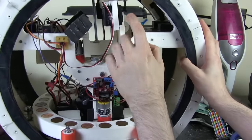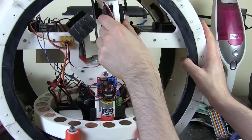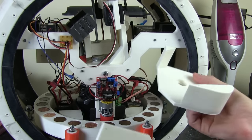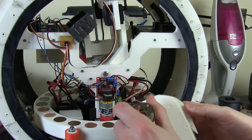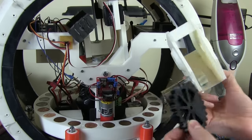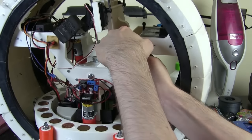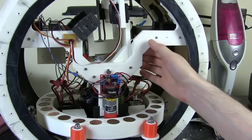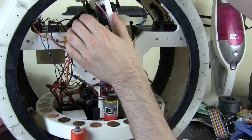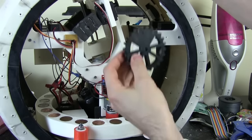With the head on top now, that has quite an influence on making it rock over, so I probably don't need that much motion. I was tempted to use servos again, but pushing this backwards and forwards requires pulling up again as it slows down, so there is quite a lot of torque required. Instead I'm using one of these motors — a 300 RPM gearhead motor from eBay — and I've built this gearbox for it. Inside will be a gear rotating on two bearings driven by the gear on that motor, giving quite a lot of torque. Then I'll have a lever coming up onto the pivot point to push this back and forward. The diameter between the hole positions is about 60 millimetres, which isn't much travel, but that is all the travel from here to here at the moment.